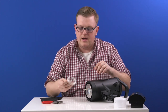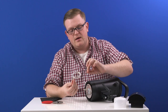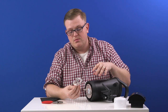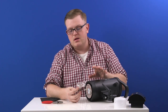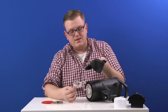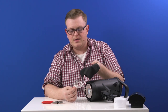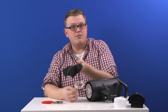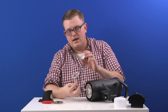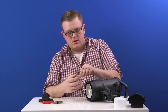Your new flash tube is going to look just like this — just the flash tube and the wire. When you're handling your new flash tube, I highly suggest using rubber gloves, or you can use a microfiber cloth or paper towel. Typically I do use a microfiber cloth when doing it, but if I do that you wouldn't be able to see what I'm doing in the video. So for the sake of the video I'm using my bare hands, but I highly recommend using a cloth or rubber gloves.